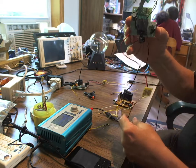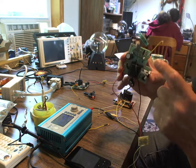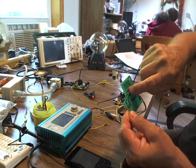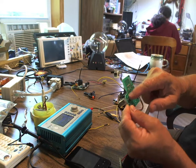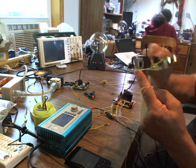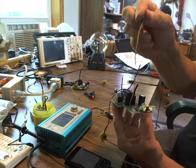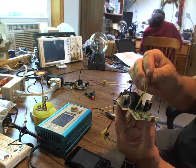Here's the controller board. Here's the blue wire that was connected — I cut it so I could give a better presentation. This blue wire comes from the controller board and goes to the position where the little capacitor came out of. It goes to the hole that has a line connected to pin number one on the transistor. This yellow wire, which I've already connected and cut, has the little capacitor on it.